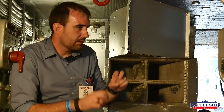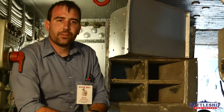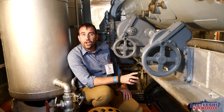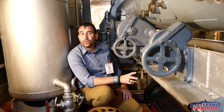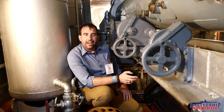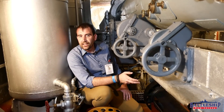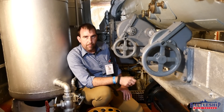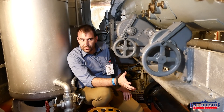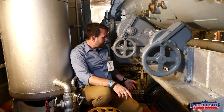Now we've talked about air conditioning — really forced ventilation — in these turrets. Let's go look at some heat. Air conditioning might have been important when Alabama was in the South Pacific, but she also served in the North Atlantic with the British Home Fleet on Arctic convoy runs, so heat is also important. Throughout most of the ship, heat is accomplished through steam radiators using steam from the ship's boilers. But in the turrets, you cannot have steam and condensate lines coming in because they rotate. So the solution is a simple electric heater.